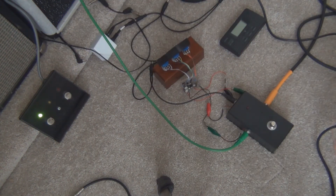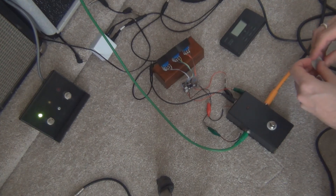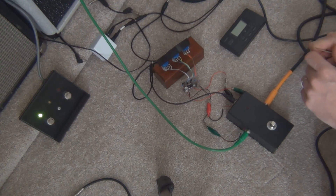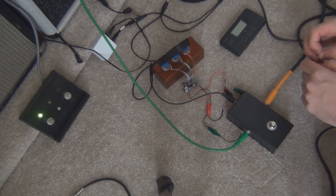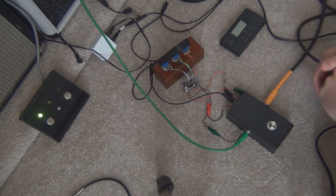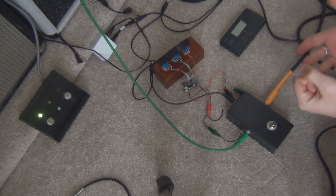So there's a few different germanium transistor combinations. I couldn't really hear a hell of a lot of difference when I was playing the guitar. I might be able to hear it when I listen back through the computer, but in front of the amp there was some difference, but it wasn't night and day. If you're worried about getting exact values for the germanium transistors, the first ones I used were between 50 and 60 HFE and it still sounded pretty damn good.